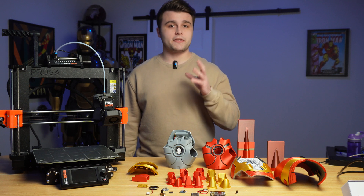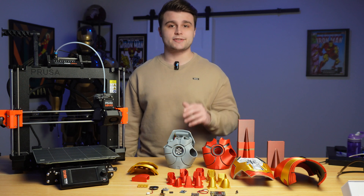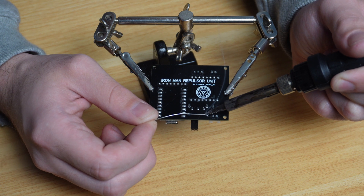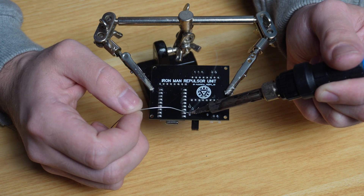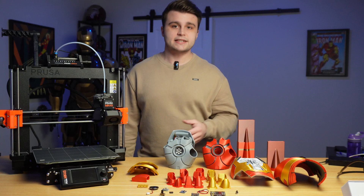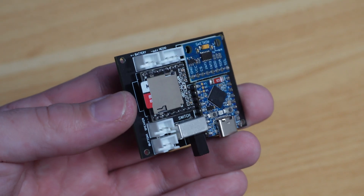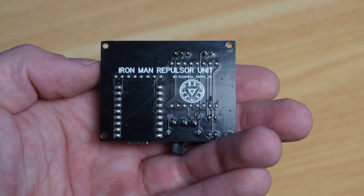While we're at it, go ahead and upload all the MP3 files from the MP3 folder onto the SD card and insert it into the DF Player Mini. With all that said, we can finally start soldering up our PCB. Start with the 1K ohm resistor underneath where the DF Player Mini will go, then solder up the DF Player Mini itself, as well as the ESP32 and the ADXL345. And lastly, solder up all the JST-XH connectors, which should give us something that looks like this.